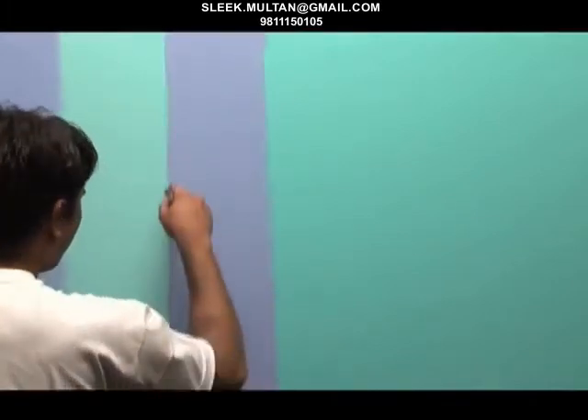Pattern creation: the first base coat is applied vertically in a small strip with a brush, followed by sponge roller. The second base coat is applied vertically in a small strip at a minimal distance from the first base coat. Then we have to merge these two base coats with a sponge roller where the width of the strips is approximately the size of the roller.